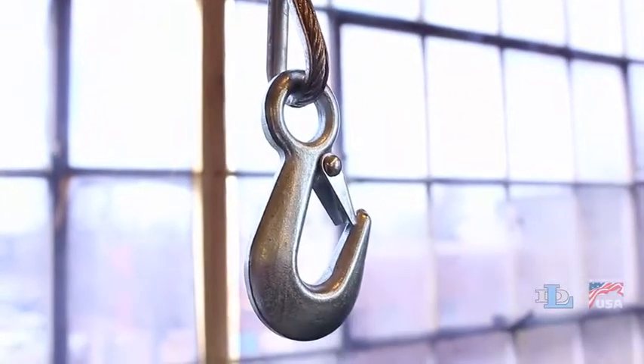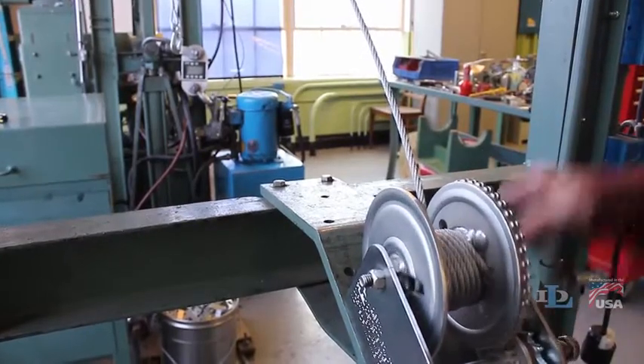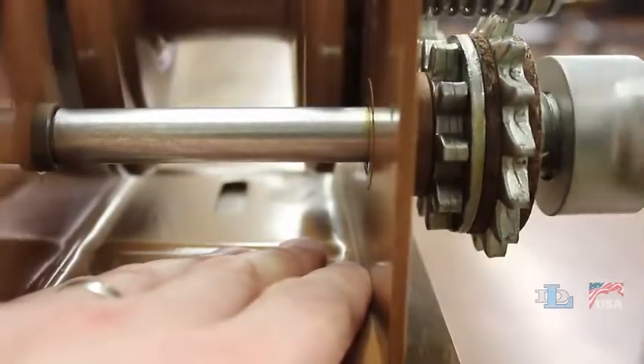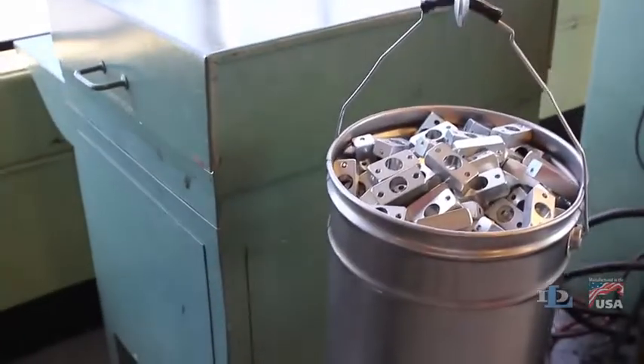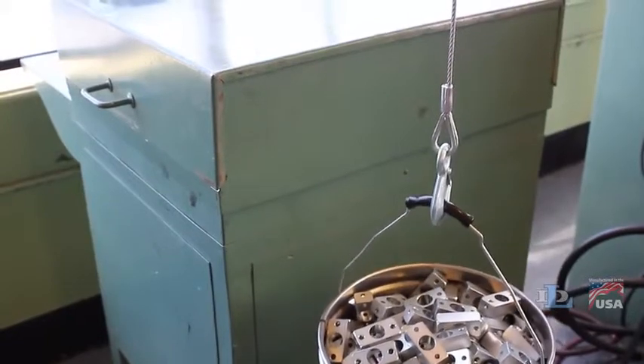This means that if there is little or no load on the winch, line may not come out when the handle is turned counterclockwise and the handle may unthread itself. For this reason, brake winches require a minimum load, which is an amount that assures the load will always move down smoothly.